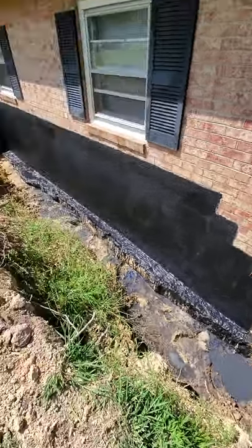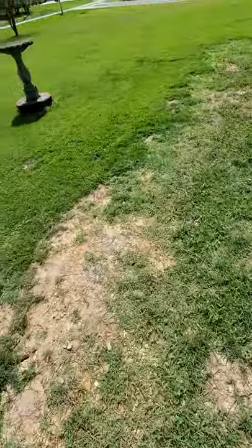A lot of professionals say do not tie your gutters — your roof water — in with your French drain. But again, they're using four-inch pipe. I'm using eight-inch and six-inch for this whole thing, so it will not cause any problems the way I've got this done. If you want to tie all the drains on your property and run them in a French drain out the back, go with the bigger pipe — it costs a little bit more, but it's well worth it in the long run. From High Point, North Carolina, thanks for watching Steam Engines USA — have a great day!